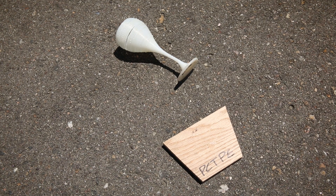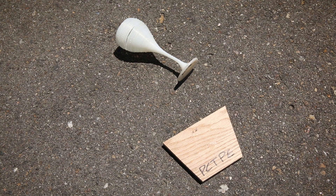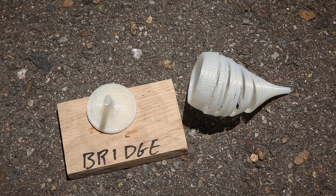And finally, the nylon-based materials. First the PCTPE — and it's our first survivor — which isn't surprising because it's a very soft, very flexible material. I'm guessing what happened is that it was pinched by the tire, thrown free of the carnage, and just rolled away. The Bridge is a little bit more structural, which means it's also a little bit more brittle, and it's done something really interesting. If you pick up the cup and pull it apart, it's actually unraveled in multiple places along the lamination lines.